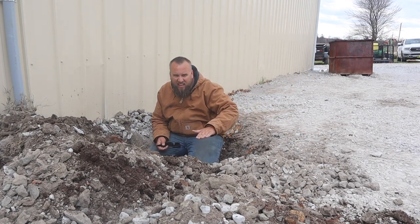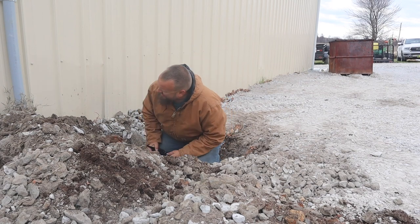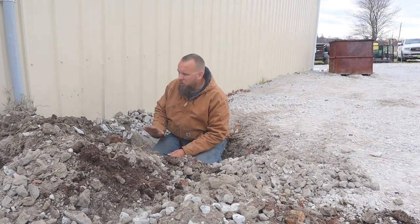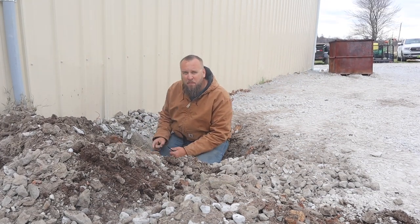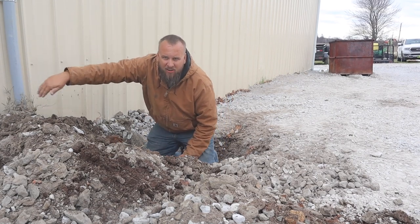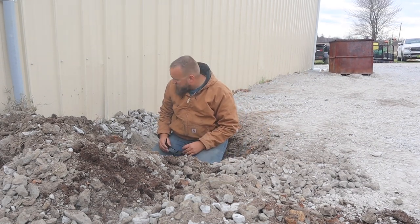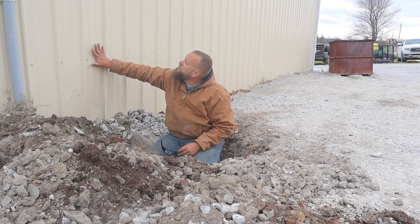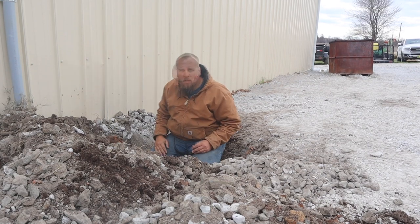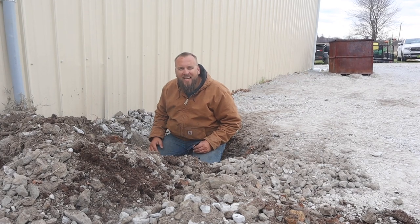Ground level is about here. I've got a hole about two feet deep and two feet wide. I think I'll move this over a couple panels and put it here, because that's not a very precise digging instrument and I didn't want to get too close — there's buried conduit from right here that angles this way, so it's probably sitting right here and I obviously don't want to damage that. I'm going to space the pole out just a little bit with a 2x6, and after raking a little debris out, we'll be ready to put the pole up. Let's go look at the light.